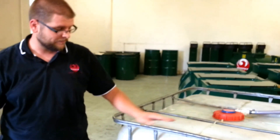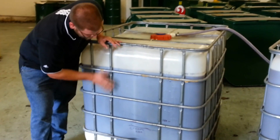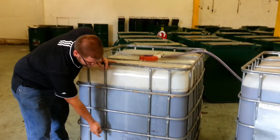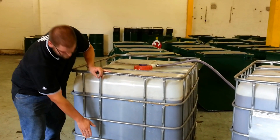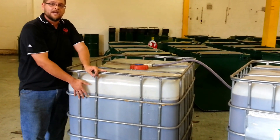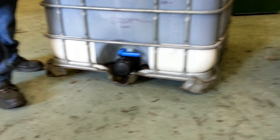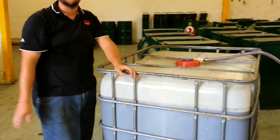Back to our raw tote: once you have filled this up and let it settle overnight, you're going to notice a distinct color change. In our system here we don't have any cream line, but our wand is 18 inches. You mapped down 18 inches and put a line — that's the bottom of your wand and you don't want to pull oil from below there. When you turn your system on, make sure your wand is not touching cream. If cream is in the area of the wand, bleed it off from the bottom valve, then continue to fill your tank with black oil. Once your tank is full enough with black oil, you're now ready to go to stage two: filter.